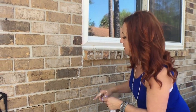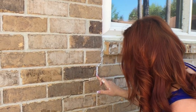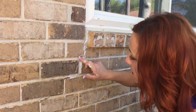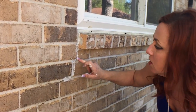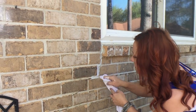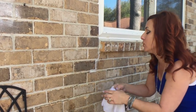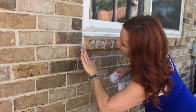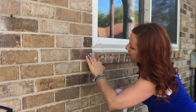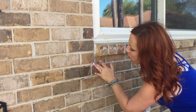Alright, this is what's really important, and you should use gloves — I don't have any handy, so I'm not using gloves. This is the part that's gonna make the difference between does it look professional or does it not, and that is simply wiping off excess everywhere except the line itself, including the grout. If you're smoothing with your finger, it tends to create lines. So the other way to get it looking really smooth so you don't have lines is just go over it a little bit with water.